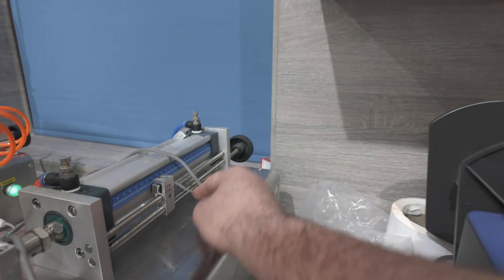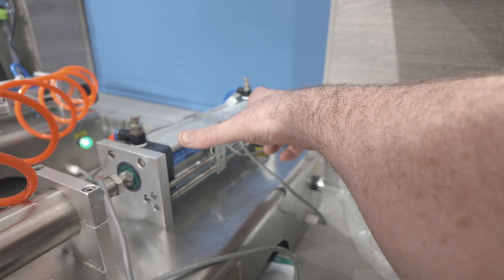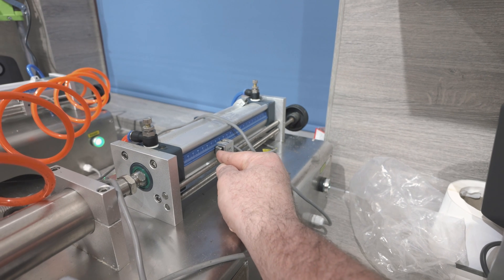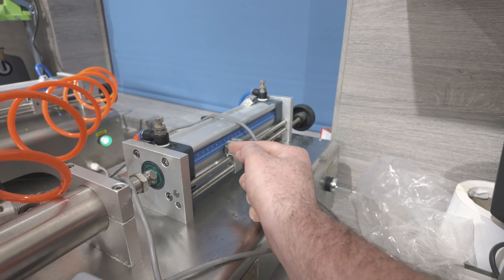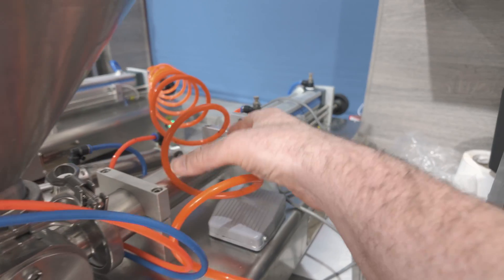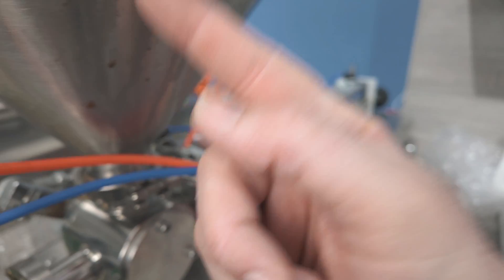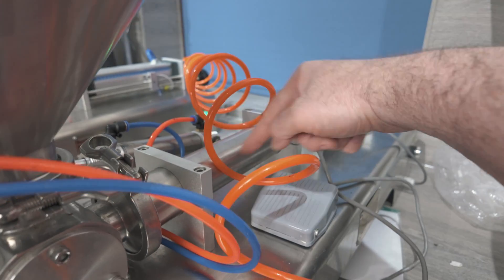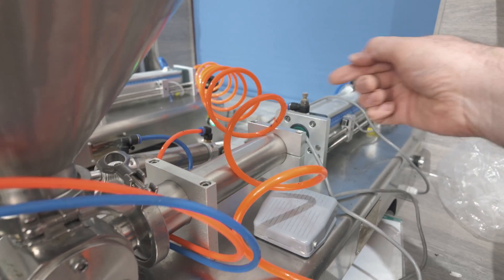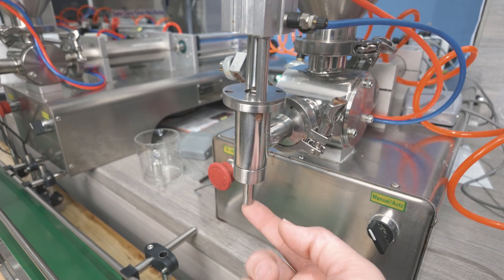That's controlled with this here. This is a piston that sits at the back, controlled by air — I'll show you the compressor in just a second. Over here there's a little sensor. This piston will go back as far as the sensor and then come through. That there is pulling a plunger, basically like a syringe. It pulls liquid down from here into this cavity, pulls the liquid in, and then the piston pushes back and the liquid comes out the end here.